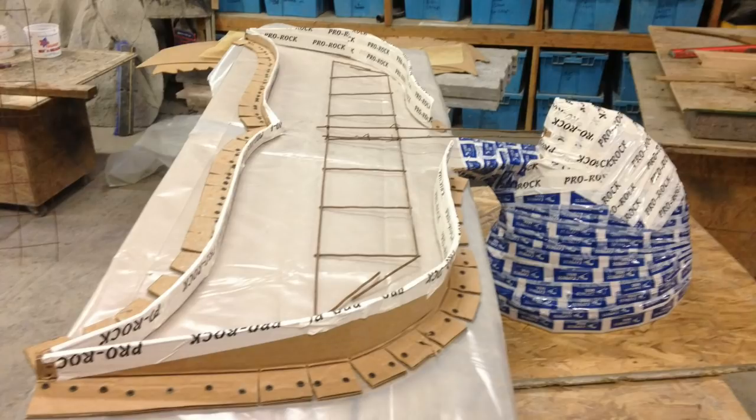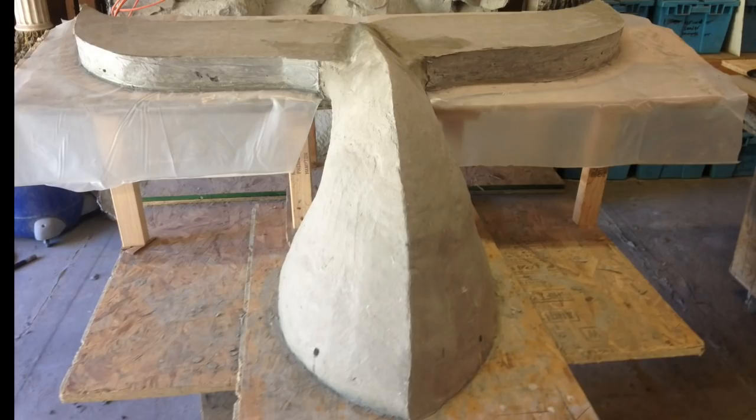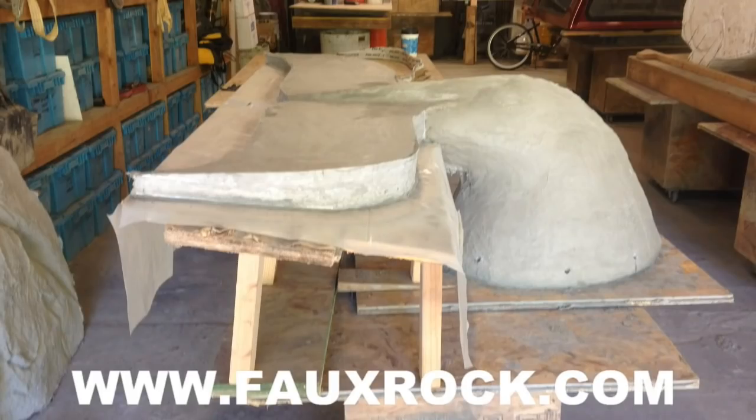After completing four benches using the cardboard template — which took four days per bench to make — I modified the cardboard portion of the process down to what you see taped on the table now. Then I made a reusable form out of wood with a cardboard outline to form the fin, which allowed me to mud the bench in one step. The result of this process left me with a very blocked fin that I had to spend quite a bit of time grinding the profile, rounding the edges, and forming it thereafter by grinder — which was unacceptable.